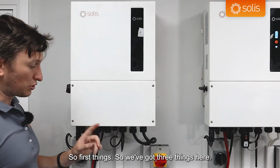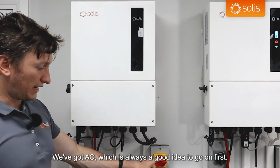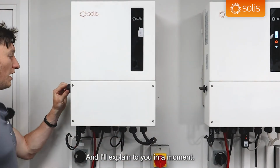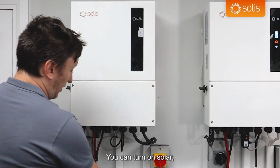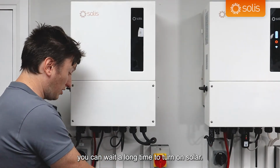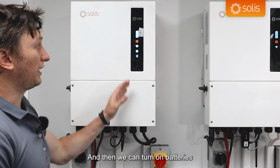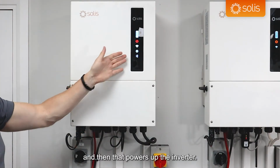So first things, so we've got 3 things here. We've got AC, which is always a good idea to go on first, and I'll explain to you in a moment. You can turn on solar. You can wait a long time to turn on solar. There's no rush or anything. And then we can turn on batteries, and then it powers up the inverter.